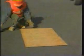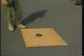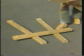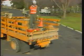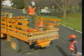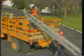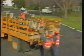For the full depth hole repair, you will need plywood forms and galvanized wire strong enough to hold the forms. You will also need wood to build the framework that holds the plywood at the bottom of the deck. A ladder will be needed in case the full depth hole repair is on a bridge where the bottom part of the bridge deck is accessible with a ladder.